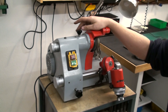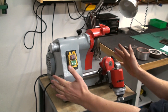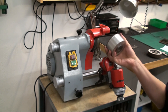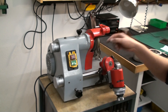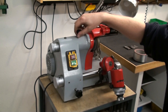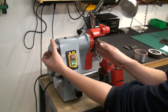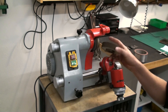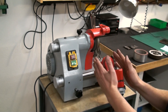This costs about 600 to 1000 bucks. Just to give an overview of the machine — it's not very large. You have a grinding spindle up here which takes grinding wheels up to 100mm in diameter, and it's made for a diameter of 100mm. With smaller wheels, the surface speed of the grinding wheel doesn't match anymore, but you can do it. The spindle can be moved in and out with this hand wheel. You need this mainly for dressing aluminum oxide or silicon carbide wheels, but it's also useful to change the work envelope.